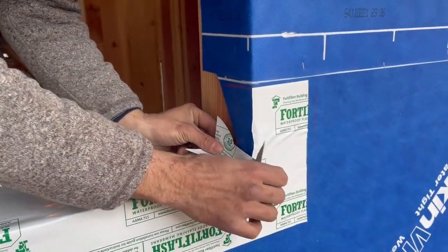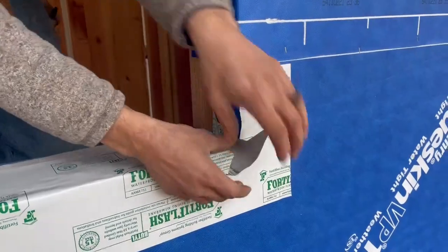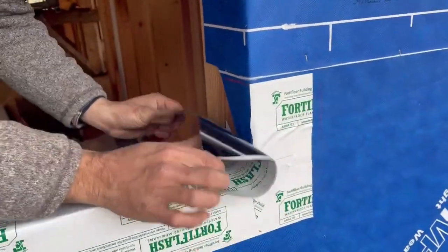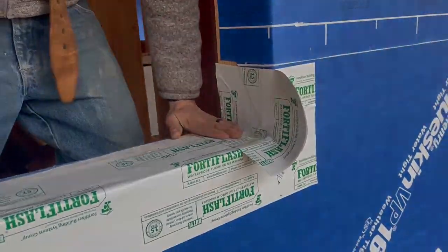Our last step is to add our butterfly corner. If you're going to have a leaky window or an issue, it will most likely be in the corner of the sills. The butterfly flashing and final piece that lays over is not something that is required, but Smitty and his guys swear by it. And who wants a leaky window?